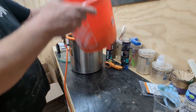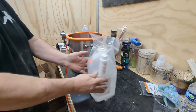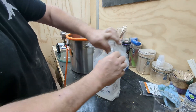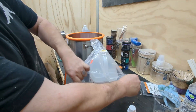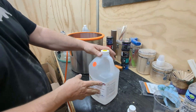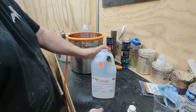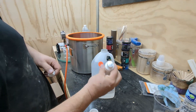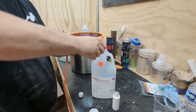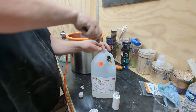I went ahead and got this wood — I already had it dried completely out inside my oven, then brought it out and let it cool completely off before I start using cactus juice. Now this cactus juice comes from Turntex. It's got a catalyst, or an activator, whatever you want to call it, and we're going to go ahead and mix that up into it, which makes it start to be usable. Once we do that, we'll have about a one-year shelf life — it never lasts that long in my shop, but that's about how long we have to use it. Get it mixed up completely, make sure there are no chunks, and then we're going to add that to it and draw that material into our wood.